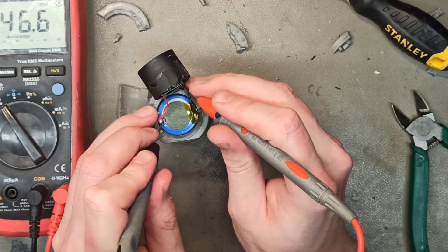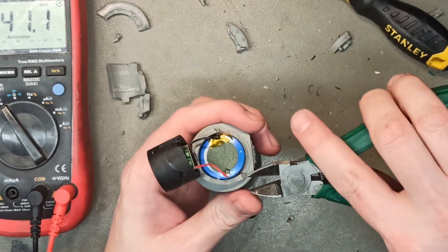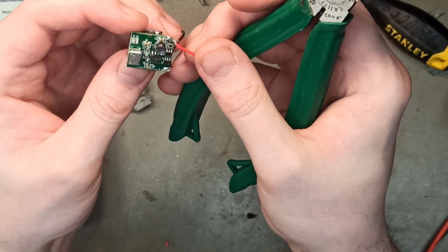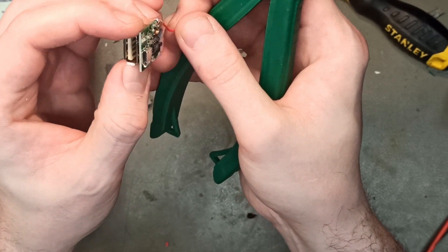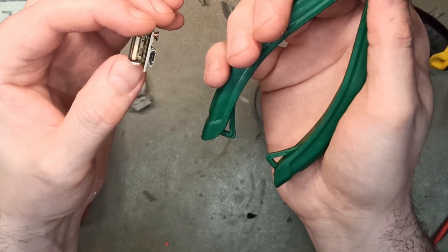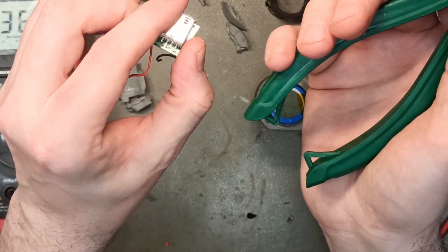146 mV — that's not impossible, but I was hoping for a little bit more. Very simple USB circuit, but I thought we can measure the voltage from the outside. I guess this circuit needs at least three volts to be able to get anything from the outside, so I won't even try.